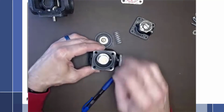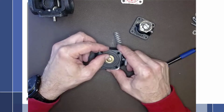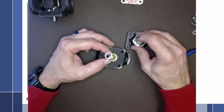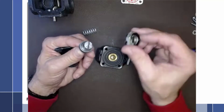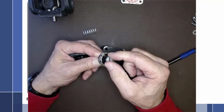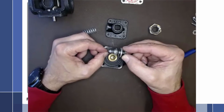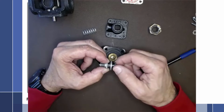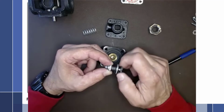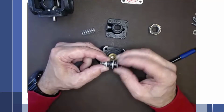So all right, getting back to this right here and how this works exactly is that we have this diaphragm here with the spring and an adjustment on the top. So what happens is this is a locking ring. So when it's together, we just tighten it up. You cannot move the adjustment. So we just back that off a little bit and now we're free to turn the adjustment. The adjustment, and this confuses some people, has left-hand threads, and you see if I went to loosen it, like to take the nut off, it just got tight. But if I try and tighten it, it makes the nut go down. But don't let that confuse you. It's actually built that way so that you can intuitively think about how things work.